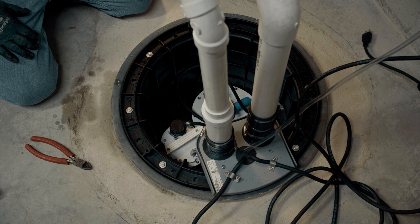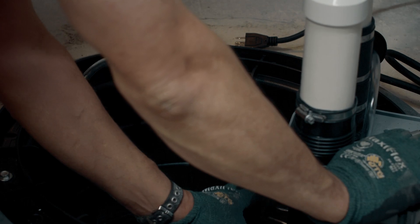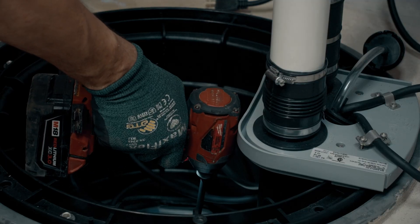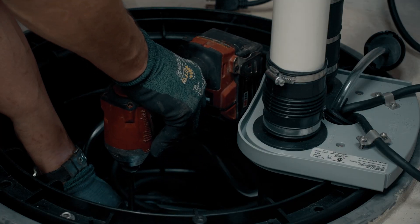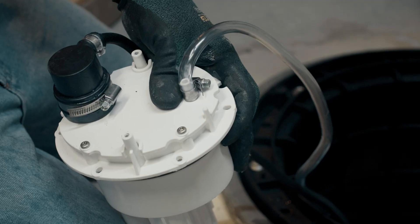This has three sensors in it — how often are they going to fail? Not very often. They're not submerged, as opposed to a typical float switch. To check the pressure tubes and the sensors for the float, we're going to disconnect the carbon filter. And as we did with the pump, we're going to give some slack on this cable so we can pull it out of the pit. On the pressure housing, take the lower set. Now we can pull the units and check our tubes to make sure they're clear. And we can get at our sensors.